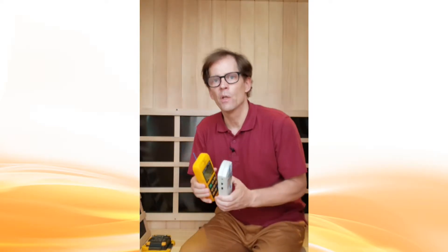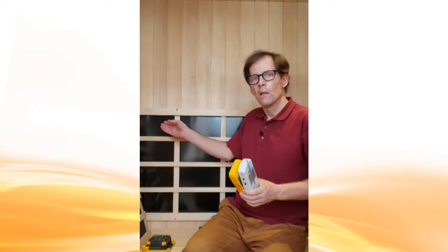I'm here in the sauna now — the new Evolve EHS — and we're just about to get underway doing some testing. We're going to test for EF electric fields with our electric field meter and for EMF magnetic fields with our tri-axis gauss meter. I have little probes mounted on top of the meters to keep testing accurate and consistent. Each probe is one inch long — about as close as your body would ever get to the heaters — which is the distance from the front surface of the heater guard to the actual surface of the carbon panel heater.